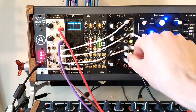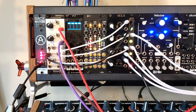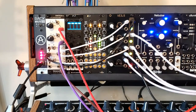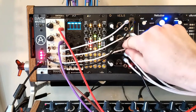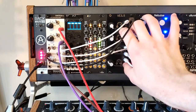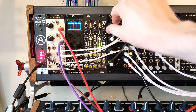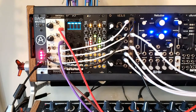From that, we can just send these DC offsets somewhere else. Except for this one — we're actually using this as a VCA, and what's coming in on the input channel is a little oscillator I made using the AD envelope on the Minibrute 2S. So this is acting just as a regular VCA, but these others are just acting as attenuators. That's the basics of how this little macro knob works — it's basically a little linear interpolator.